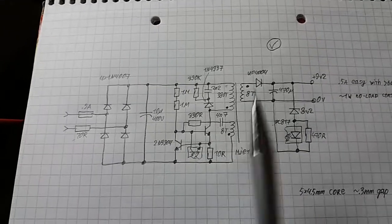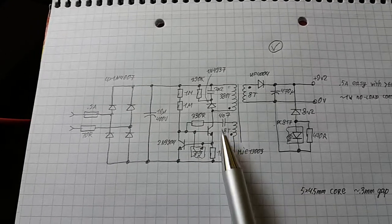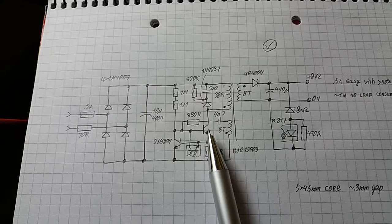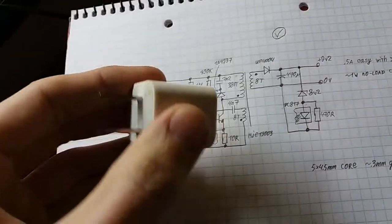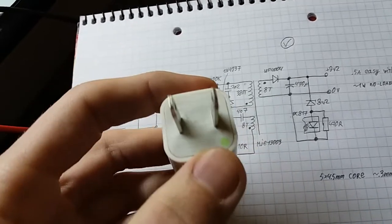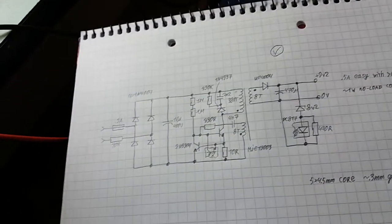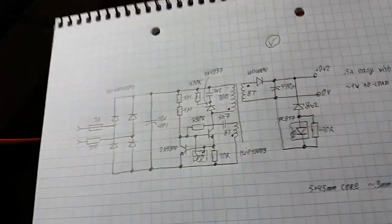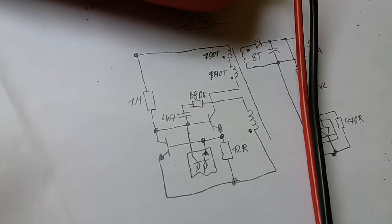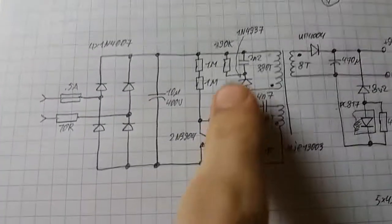Now the original circuit is a circuit that I saw in Danyk's video, and that was a re-engineered circuit from a cheap Chinese charger, like this kind of deal. You know that. We all know that. Designed in California by Pepple or something like that, with weird pronunciation errors and stuff like that. Now that circuit looks much more like this. The difference is that this one has no snubber and my circuit does.